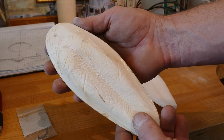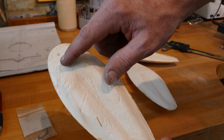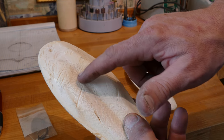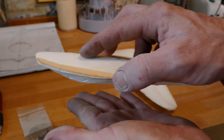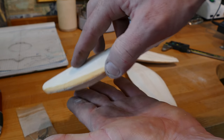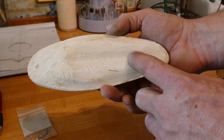What I want to do is carve into this for this first project and make a ring shank that we're going to be able to fold around and solder. I want to capture this texture in here, but I want my texture to be a little bit longer. So instead of smoothing this thing out flat, I'm going to smooth it out at a slight angle, and that's going to give me elongated texture patterns.